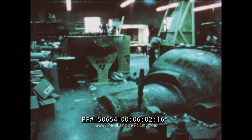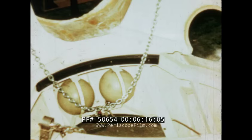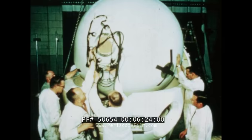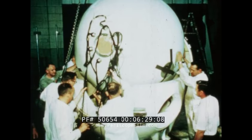After fabrication and finishing of the component parts, the final structure is assembled around the metal framework. The various components, such as the hydraulic main propulsion unit, the ballast and trim tanks, and the various controls, are all assembled together in the superstructure. The spherical pressure hull is fitted in place. Then, the fairing and conning tower are assembled over the pressure hull.